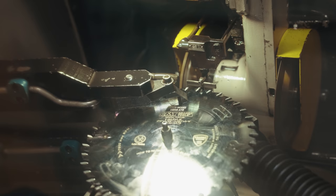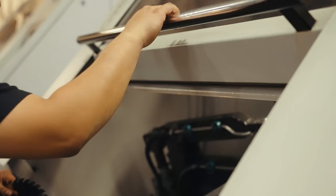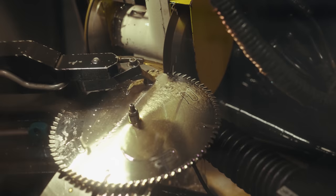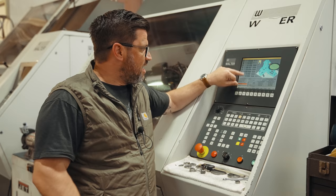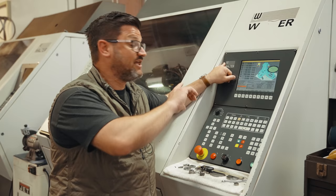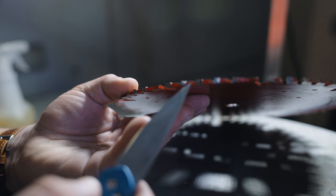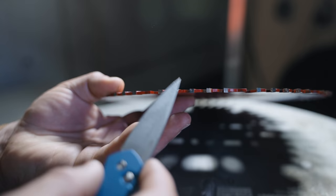After we programmed the machine — and as a guy proficient in using three-axis CNC machines — it was mesmerizing to watch how it could do every aspect of the cut without changing anything. One of the things that's absolutely impressive is when you look at the DRO, these are cutting to three decimal places of a millimeter — not quite microns yet, but getting down to a level of precision that is pretty incredible. Here we have a broken tooth, so Juan is going to show us how they take the tooth off and braze on a new one. You'll notice how much bigger the new one is — that's what I was talking about earlier, how impressive it is that the machine will grind a whole tooth down to size before moving on.